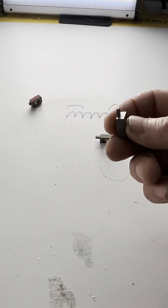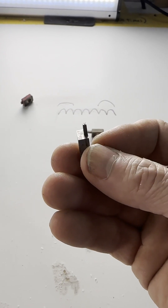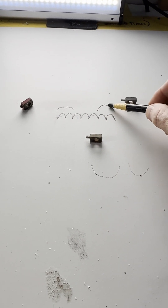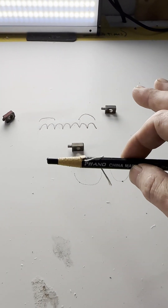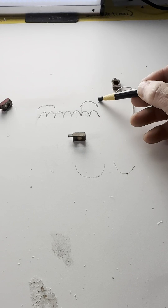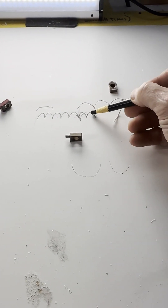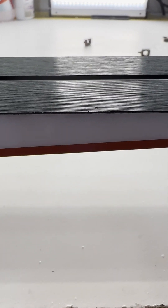B363 Plus utilizes this diamond, which makes really nice cuts in the moderate to wider range, and we cut a shape with more depth and more roundness to it. We float it in much lighter. A lot of these structures are floated onto the base, not just buried. We take these little hills and float the valleys down in, clearing out some of them but leaving some texture, and we get a busier, deeper, and more turbulent structure that can move more moisture.